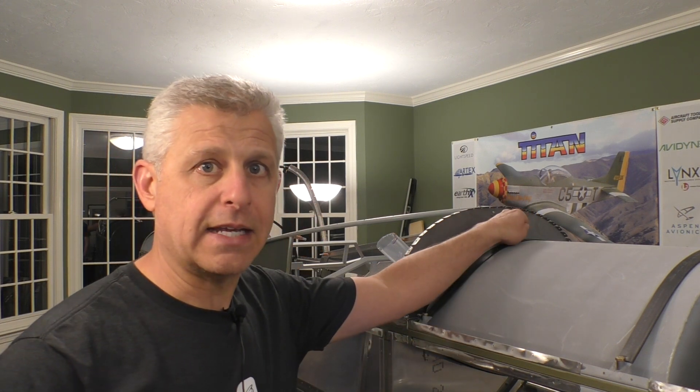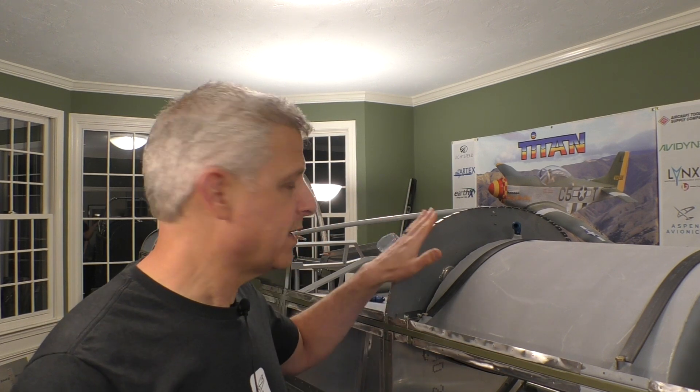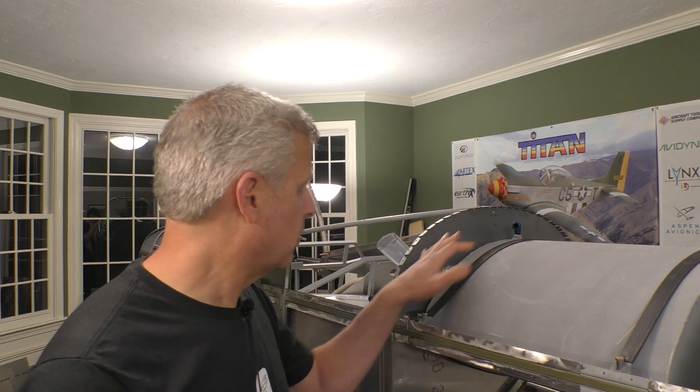In any tank you need to have the feed, which is at the bottom, and then you also need to be able to vent it. So we're putting in fairly large venting with rigid tubing from here, and then routing it down and out the belly of the aircraft. We're doing that because once this metal turtle deck is glued and riveted into place, we're not going to be able to get back in here, at least not very easily. So I want to get all of this set and secured and be as permanent as possible, and give us as many options as possible in the future.